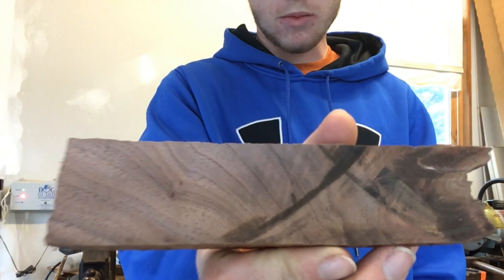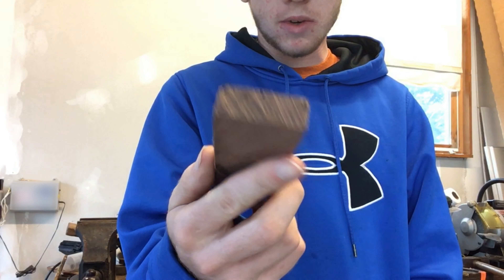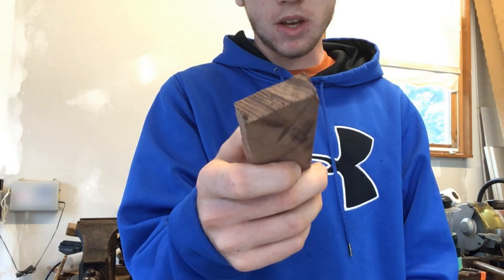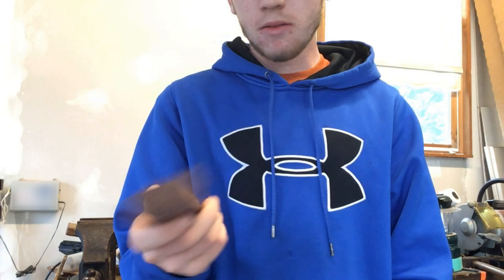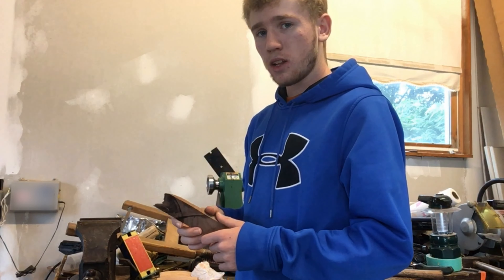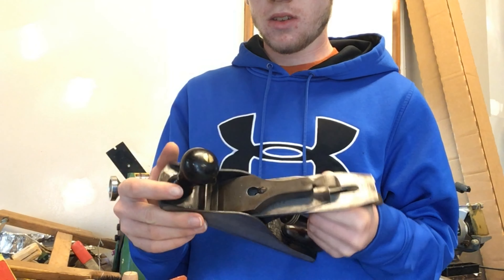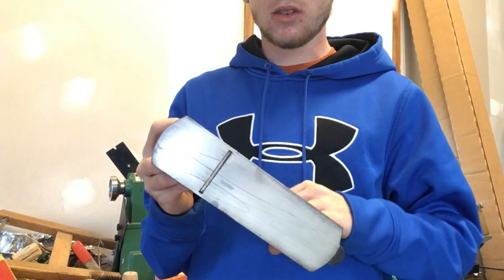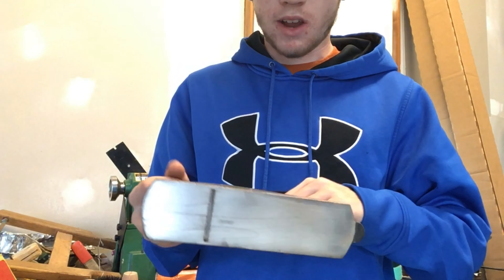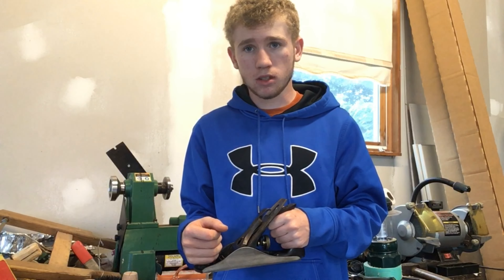You can see it's all burned up from the table saw, but I'm going to go over to the band saw, cut out a square, maybe plane this down. I'm going to get the plane — plane this down, then file and sand it smooth so it looks real good, then throw on some kind of stain or clear coat. I'm using my Stanley number four bench plane here — I restored this and I'll make a video at some point on how I did that. I'm planing this down just to get those table saw marks out of it.